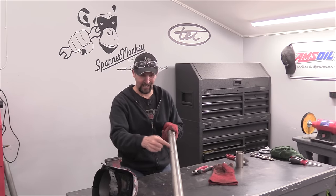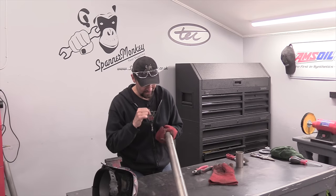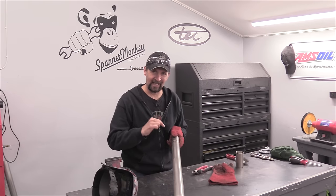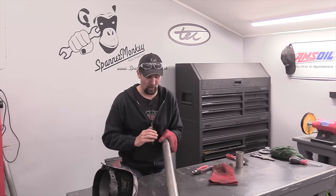Right, there we are. First ever pass of welding stainless tubing with stainless wire. Lovely. Initially, a little bit too much power and just pop through it. So drop it down to minimum power on a very low wire speed and just tack it all the way around. It's not clever stacking tacks, but if it works and it gives you a reasonably nice looking weld that you can flat back, then it really doesn't matter.